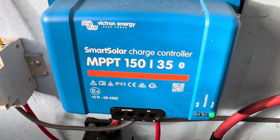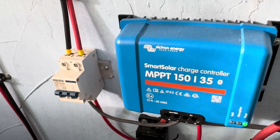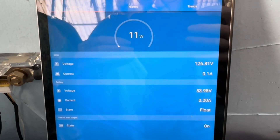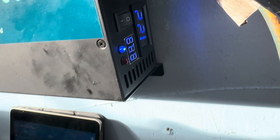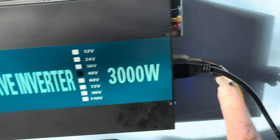It's about 2:30, so it might go all the way to float today. Several hours later — made it to float, as you can see by the green light on the charge controller. Everything is going good. Take a look at the app — only 11 watts coming in right now to hold it at 54 volts, which is exactly where I have float set to. Everything looking good. I have been using this inverter with the whole time on. No weird noises. Ground tomorrow's coffee already.